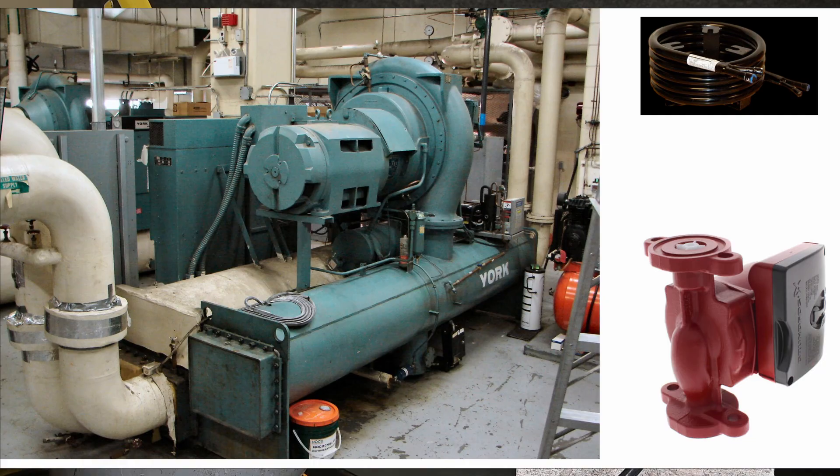Any time we do recovery with a chiller system — where we're taking heat out of water, have a water-cooled condenser, cooling water, or glycol — we want to make sure the water is moving, with pumps on and water flowing. What's going to happen is we recover refrigerant quickly, the temperature and pressure drop, refrigerant starts boiling from liquid to vapor, absorbing heat, and if there's water around, it could freeze and damage pipes very easily. By keeping the water moving, the large quantity of fast-moving water prevents freezing or reduces that risk.